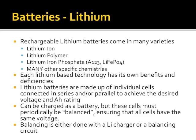In the case of ham radio stuff, being in the 12-volt world, you'll usually see 4, and you'll see why in a moment. Another thing that's important is, lithium packs, because they have such narrow voltage ranges for operation, you have to do something called balancing. In a 4-cell pack, there are specific charge controllers out there that make sure each cell in the pack is exactly the same voltage.